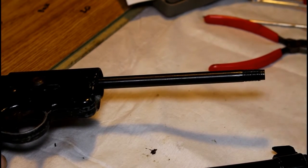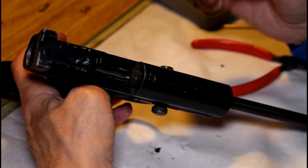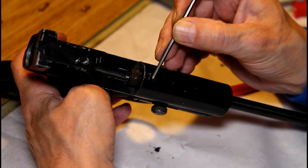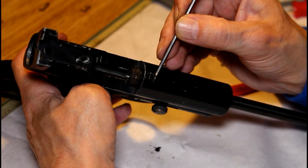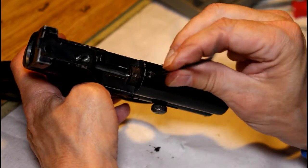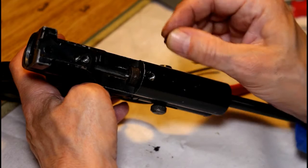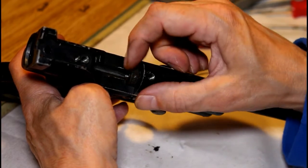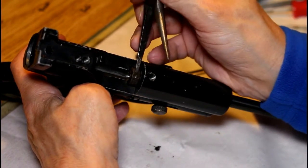After labelling up and putting the housing on the board, we continue with the disassembly. The next instruction is to remove the grub screw on top of the gun - that's the barrel set screw located on top of the front section of the receiver. We take that out now; it just sort of holds the barrel in place and I suspect it lines up with something on the barrel itself inside. The next thing is to take the nut off that holds the barrel into the receiver itself.